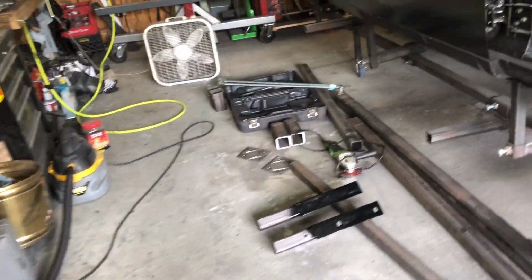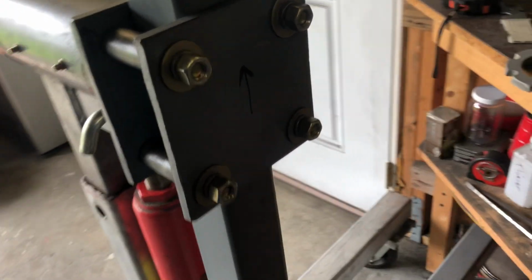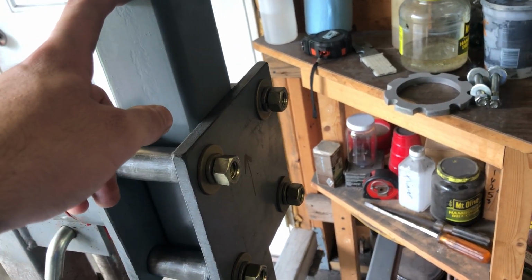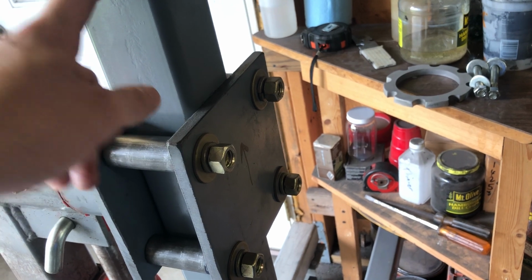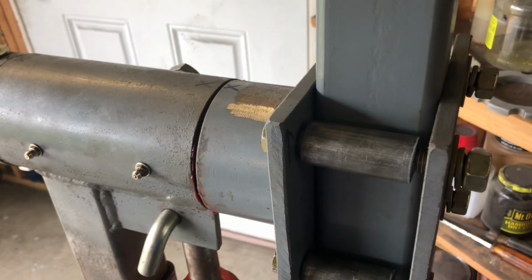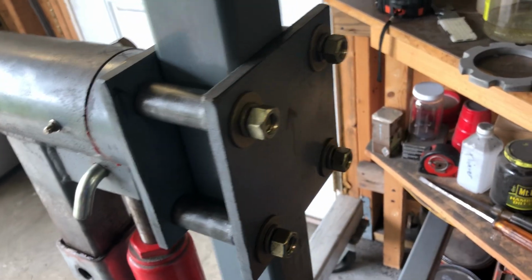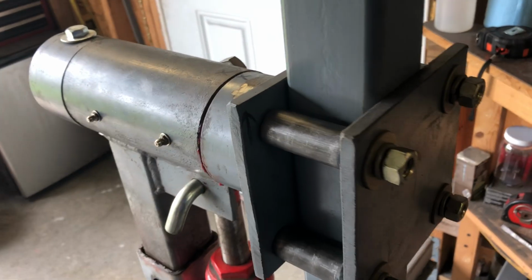But anyways, in my genius of thinking, one of the rotisseries uses essentially the next size up pipe, kind of like how I'm doing the slip joints with the 1/2 inch difference, because this is like, I don't even want to quote what size is 3/16 wall, I think. So it's just under 1/4, so it's a fairly snug fit, but it's not a super tight fit. It's still got some play in it, but it allows it to slip together.